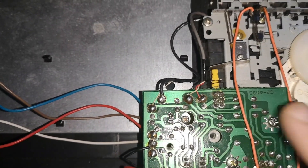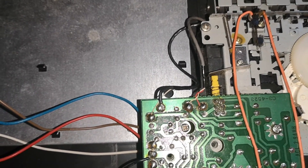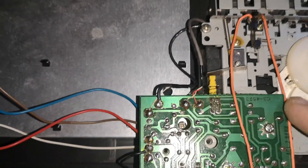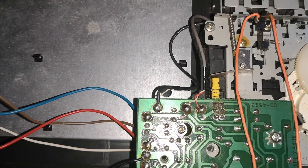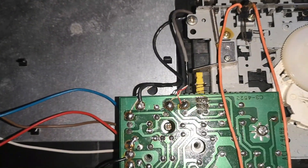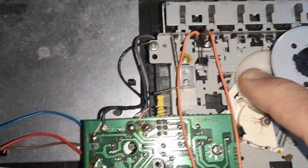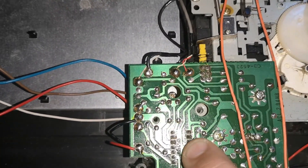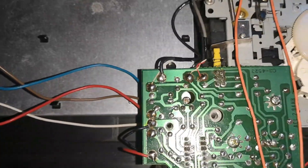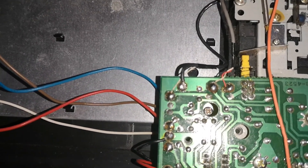With these not earthing the body well enough, you don't get any sound out — it looks like it's acting on the output, so the output isn't being grounded and you get no sound into the machine. It's worth trying before you start swapping any parts. Normally the decks are okay, and you just need to check the amplifier circuit. Unsoldering that chip isn't too much of a chore, but we'll cover that if needed in another episode.